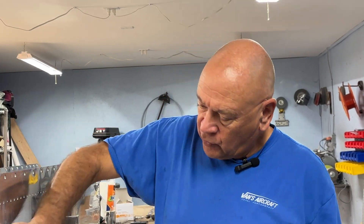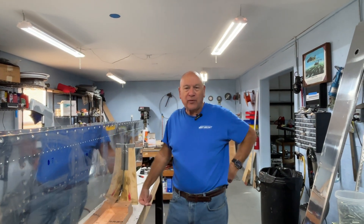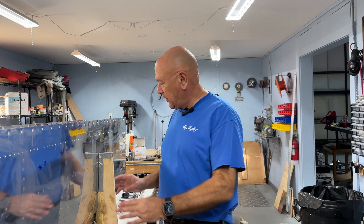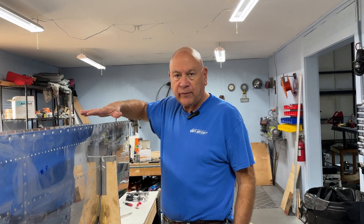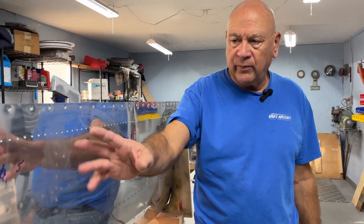I'm sure I look tired - it's been a long day. Earlier this morning we showed the start of the other fuel tank, which would be the right fuel tank. I put all the lower stiffeners in on the bottom side, so those all got riveted this morning. Then this afternoon I convinced Carol to come out and give me a hand, and on the left fuel tank, which I had done the stiffeners on the other day, we managed to get seven of the nine ribs in.